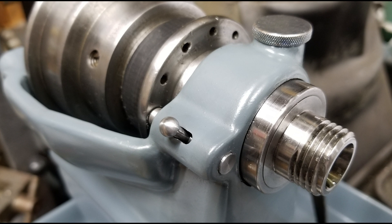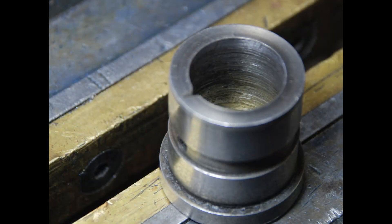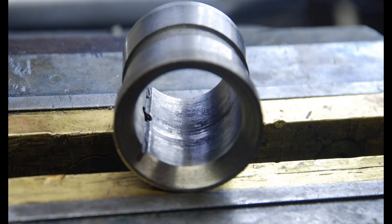While I may have taken the long way home, I did get it to work and will describe in this series how I went about it. Here's the inboard bearing pressed out of the headstock. It's a hardened steel bearing that runs on a hardened steel shaft, similar arrangement to a watchmaker's lathe. And you can see from the scoring inside — this lathe was run without oil — and you could literally, with your hands, wiggle the spindle shaft back and forth and it would rattle on the bearing. The whole thing is just completely destroyed and every surface needed to be addressed and redone.